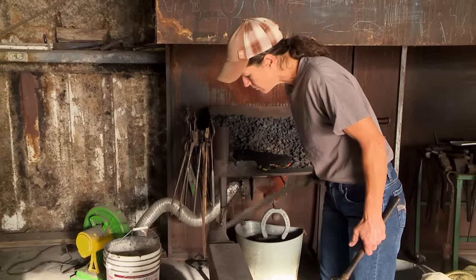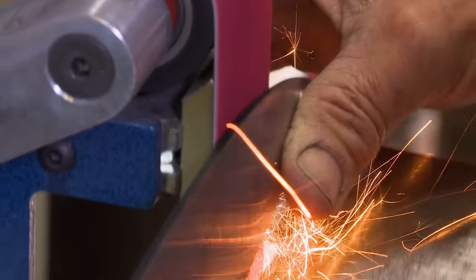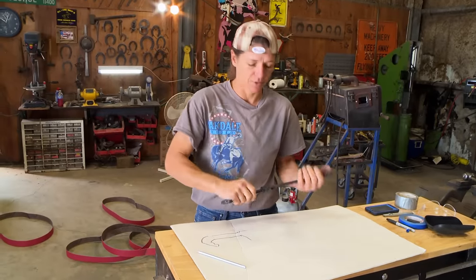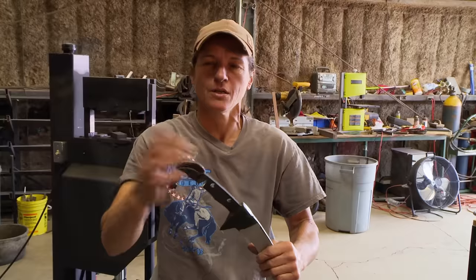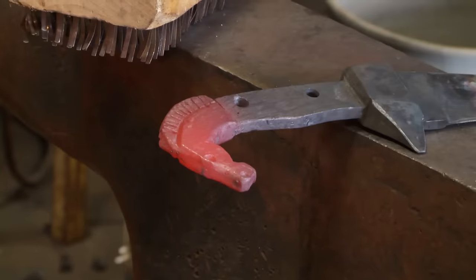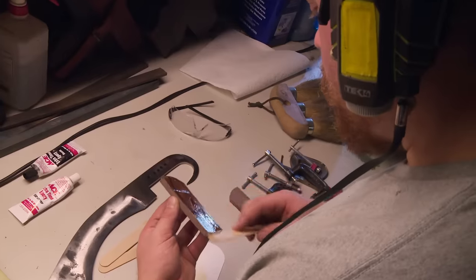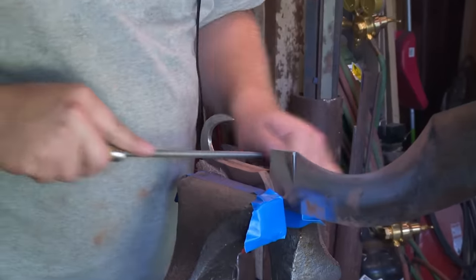Day three. I'm feeling really good about the progress. The heat treat went really well — everything's nice and straight, so it's just chugging right along. I'm going to tighten up the handle a little bit because historically it kind of wraps around and protects your hand. I cut out a V in the mild steel, then took a hand torch to heat it up and bent it around and re-welded it. I like the shape of it better now — it welded up nice, you can't really see a seam. It's my last day. I need to get a finish on this blade, glue up the handles, and then sharpen them. Making a blade this big with just the tools I have at my disposal is a lot of work, but I think I did as good a job as anybody could do, and I feel this is a winning weapon.